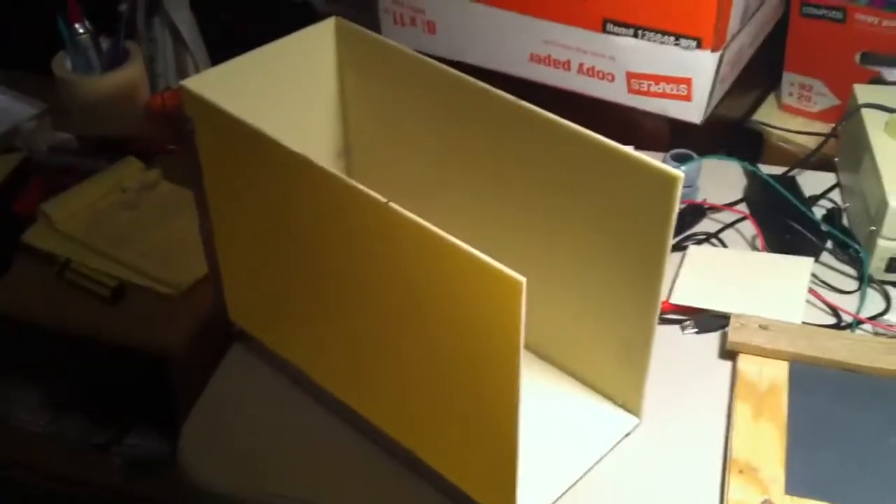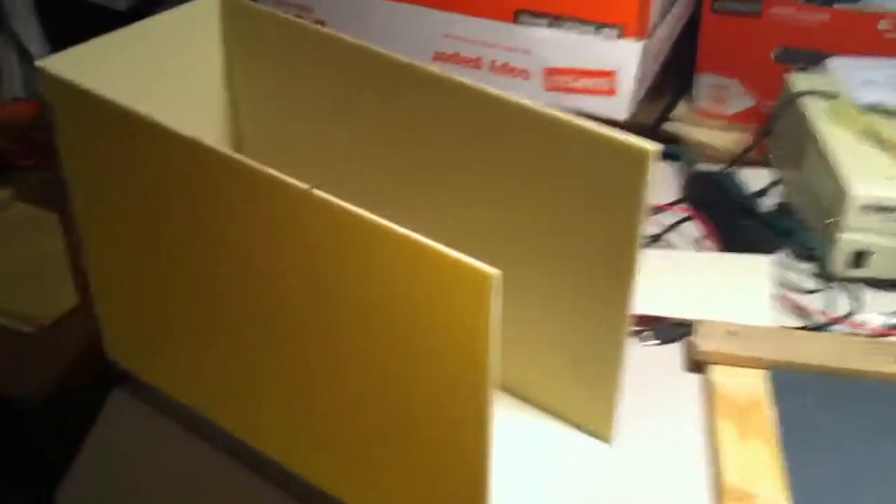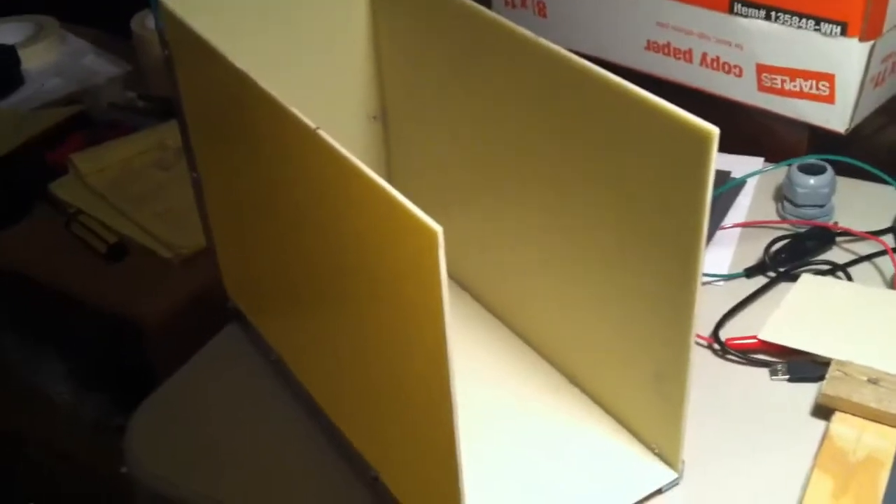Video 28. You're inside of a battery box. This is the prototype for the first one that I'm building. This will hold 48 cells of those little pouches. I'm using sheets of G10 with some aluminum angle riveted in for the corner positions. I'll make a good sturdy box, fireproof and impact-proof.